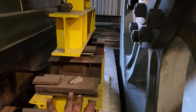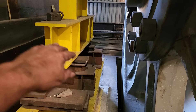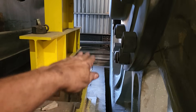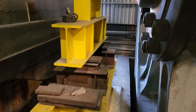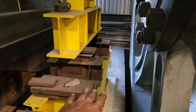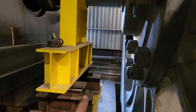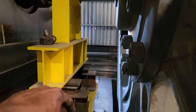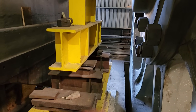The concrete will be here next spring. It had a depression in it because the governor wheel is eight foot in diameter and so it extends down a little bit, so they had a depression. Well, when they put that pan in back in 1913, they forgot to grout underneath the pan between the pan and the concrete foundation, and there was a little bit of a gap. At some point in this engine's life, they either tried to jack something up against that pan, or took the governor wheel apart and dropped the lower half down onto it, and broke it in about three or four different places. There was a huge crack running down through it.